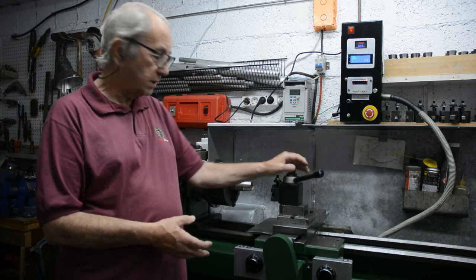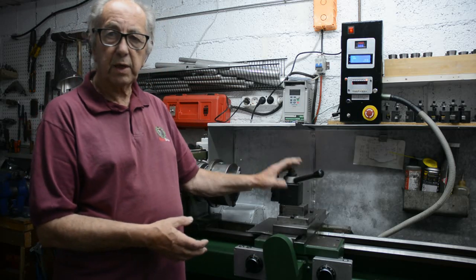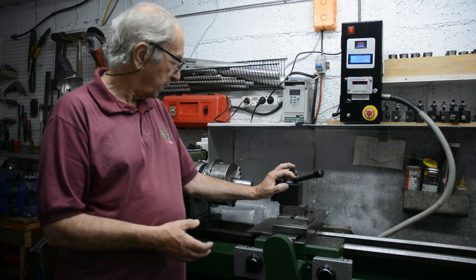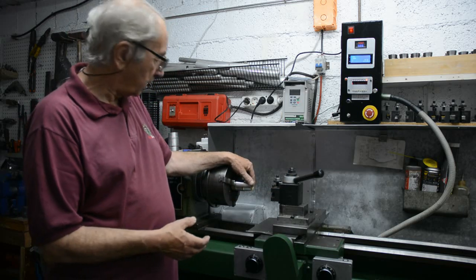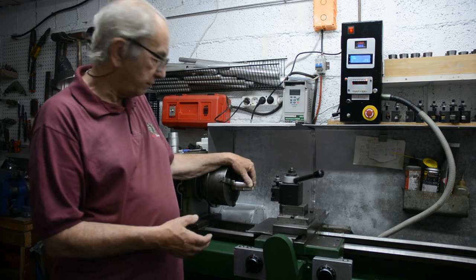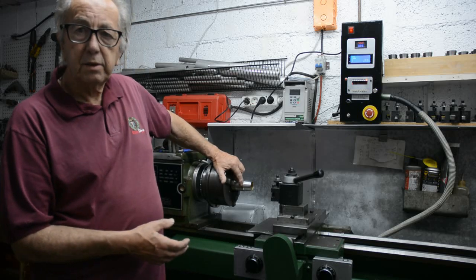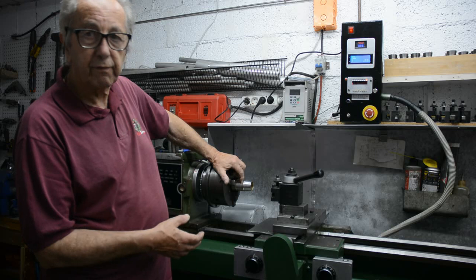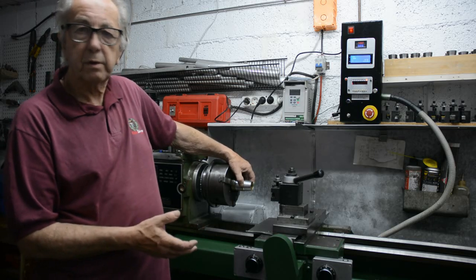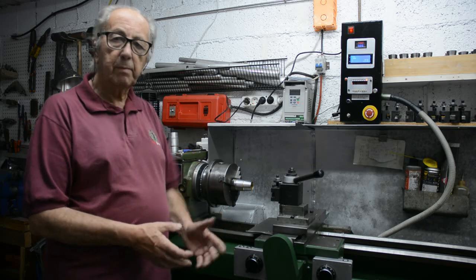Basically I want to do normal turning in each direction, I wanted to be able to face off in each direction, I wanted screw cutting, I wanted to turn tapers, and I wanted to turn curves on the end of pieces - either convex or concave curves - and also in the side of a bar. It's useful to be able to turn a concave section, which comes in handy if you want to make some formers for a tube bender, for example.